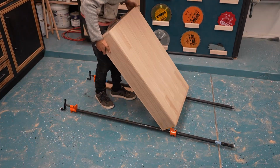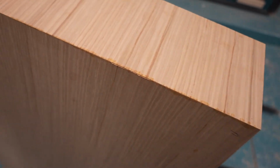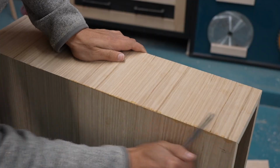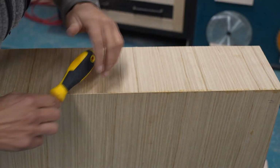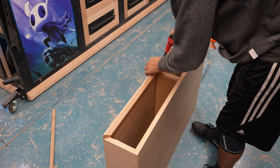Both pipe clamps, you can just buy the longer length pipe and they still work great. If you plan on doing any kind of work like this and don't own them already, definitely pick up some pipe clamps and parallel clamps. They have paid for themselves 10 times over since I got them. One of the joints opened up a little bit during the glue up, but the edge of a screwdriver closed those gaps right up.